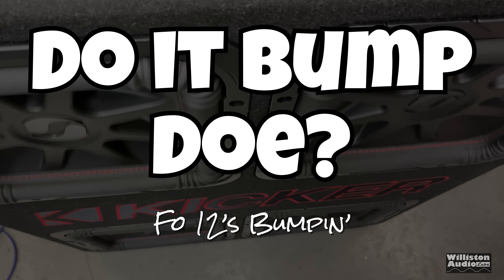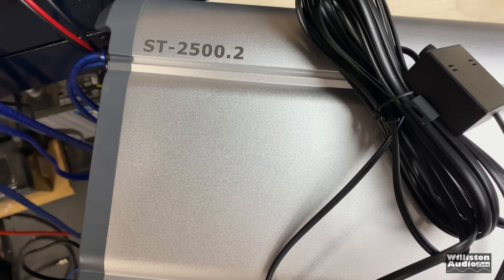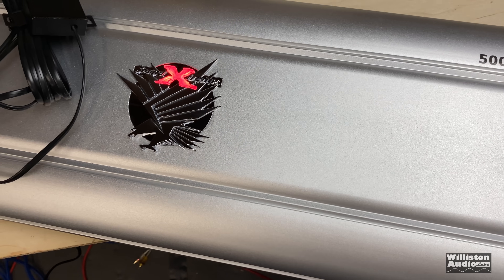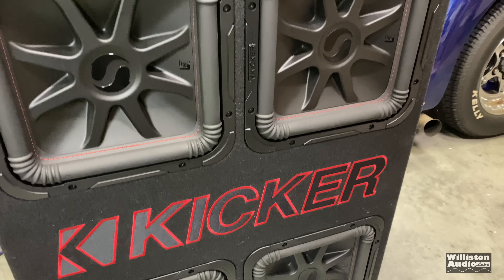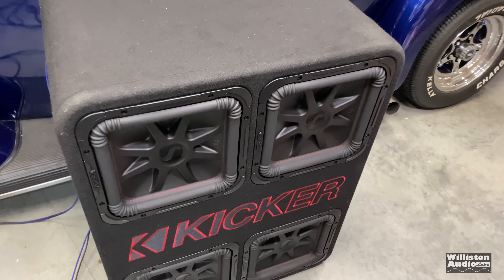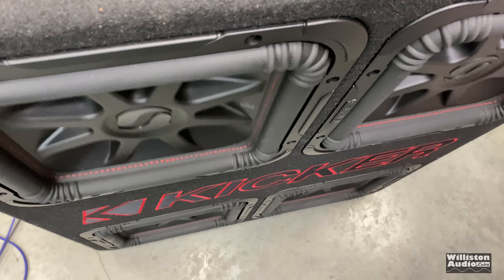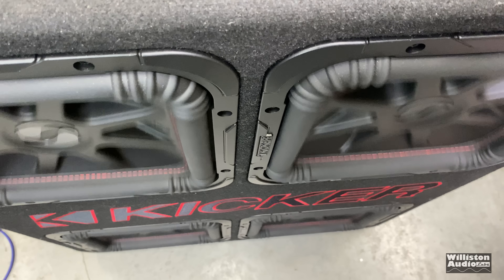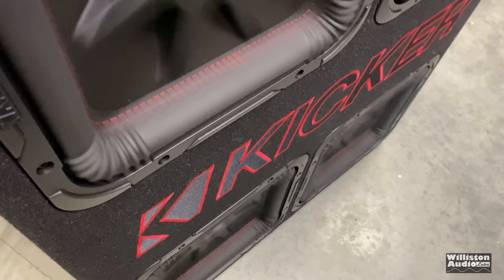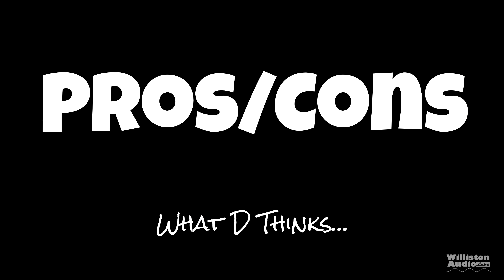Now let's try out this huge, not-5,000-watt ST 2500.2 with a Kicker quad box. The quad box has two 2-ohm terminals with four 12-inch subs, so we're wiring it at 4 ohms mono. Alright, how about a little woofer test? As you can see, that 600 watts was enough to move those four 12s in a very efficient box.